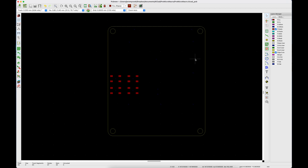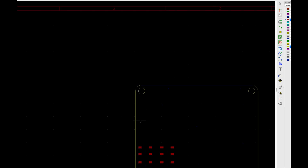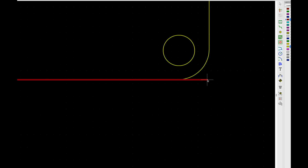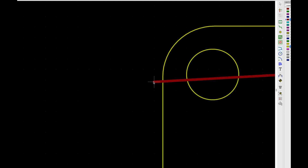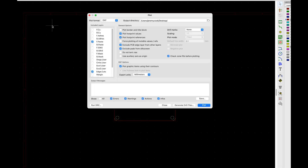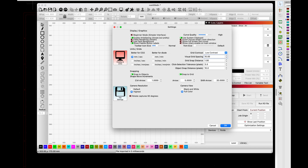As alluded to earlier, I did make a laser cut solder stencil for this PCB. You could probably just order it from PCBWay or whoever else you're using, but in this case, in KiCad I drew out the outline on the solder paste layer so that when I exported it, I'd have a nice outer layer I could line up with the board, with all the WS2812B LEDs lined up, so I could just put the solder paste on, heat it up, and be done with it. Or so I thought.